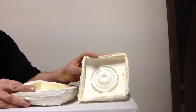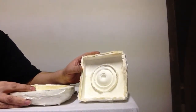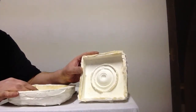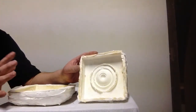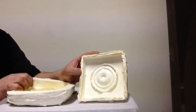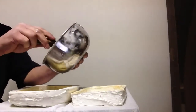I'm going to go ahead and fill both of these molds with plaster. I've used plaster of Paris or molding plaster, and we're going to make a rosette — a replacement — without going to the mill shop. When you see how much they're going to charge you for a couple of these, you might be interested in making one out of plaster, especially if your woodwork is painted. So I'll go ahead and mix plaster and fill these up.